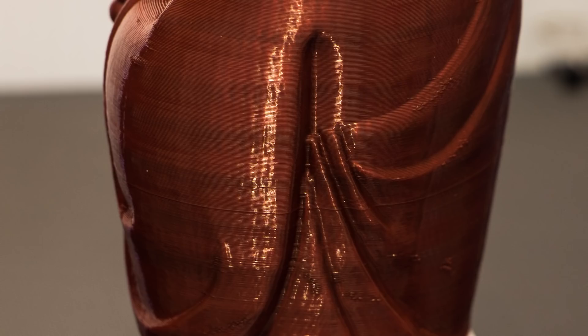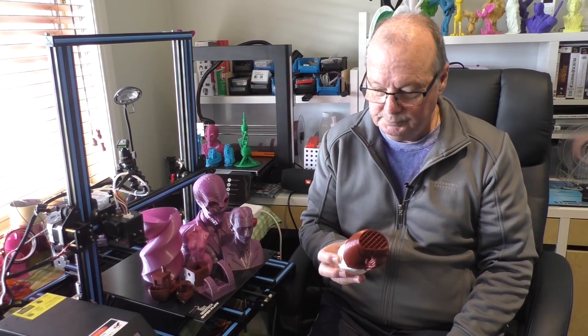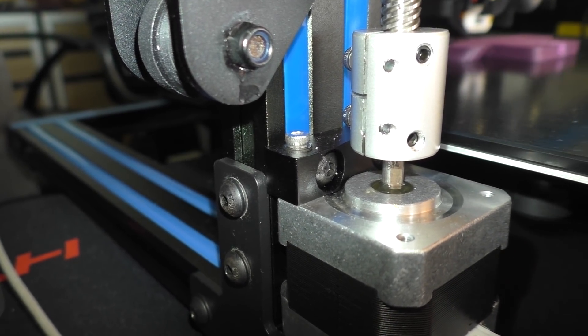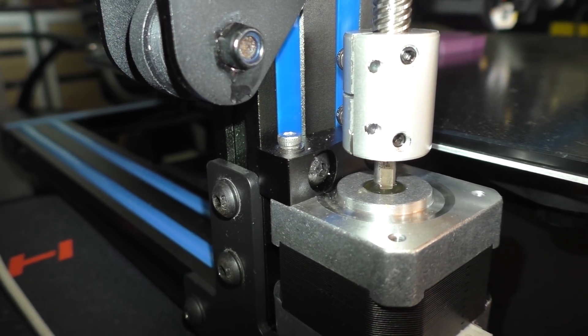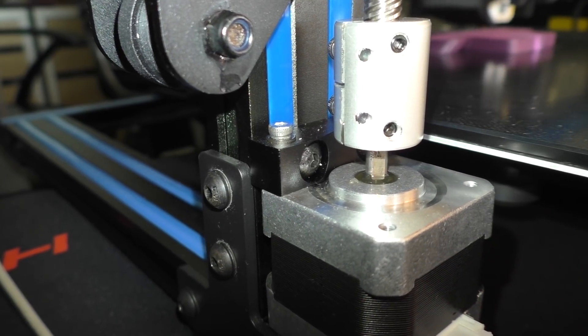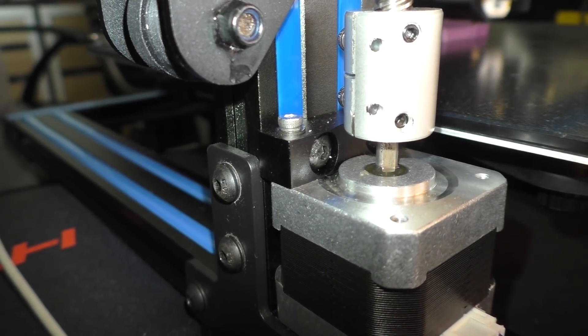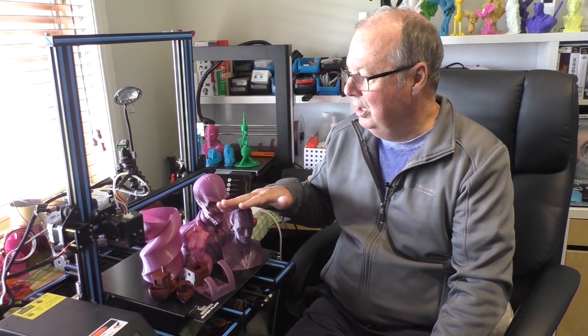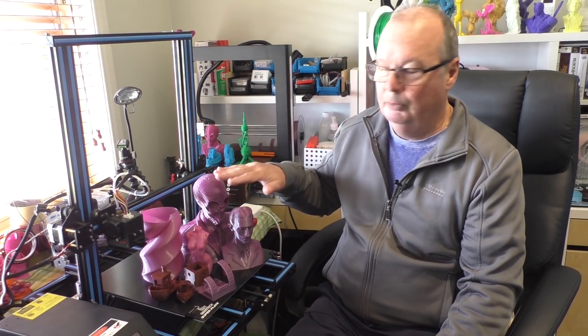The rest of the print is very rippled — it has a lot of Z defects. So I had to go looking to find out why. The motor mount on the left, as you'll see in the clip, has mounting screws which are T-nuts that go into the slotted aluminium of the frame. Although those T-nuts and screws were tight, the T-nuts had not engaged in the slot of the frame — neither of them. They were tight on themselves but were not tightening against anything, so the motor was flopping around all over the place. That is definitely a quality control issue with G-TEC. That should never happen.